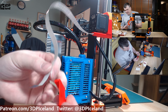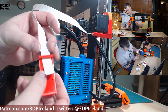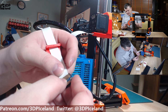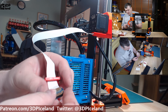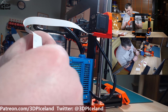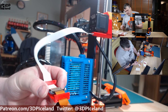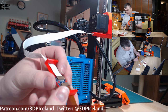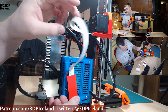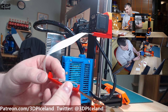This piece gets placed from the top side, going inside the plastic with the connectors facing out. Take the Extender Thingy, open up the connectors, and plug it in — be careful not to break the clip that clamps the cable. Then take the shorter cable and plug it into the opposite end of the Extender Thingy. Thread it down through the hole. The PCB snaps onto the pegs on the part. Because the cable is a little too long, push part of it so it goes up against the plastic end — that bend in the cable is fine.